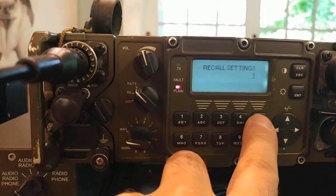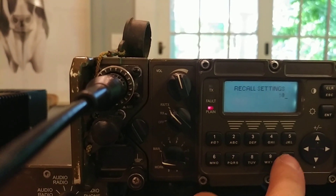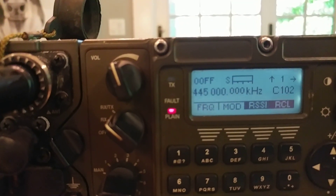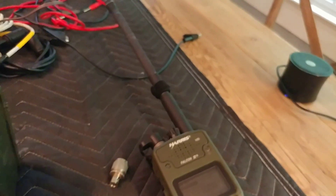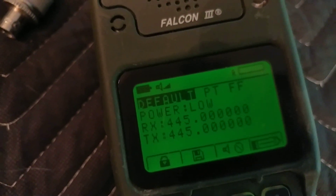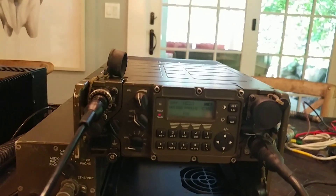Now let's recall channel 2 — let's try 102 — there we go. And here you will see the radio is at 445 megahertz — 445,000 kilohertz. You can see it's on low power, 445 megahertz for both RX and TX. I had to configure them both for tone squelch — 150 hertz tone squelch. Let's see what we can do here. We're going to transmit on the Harris and we'll hear it here.